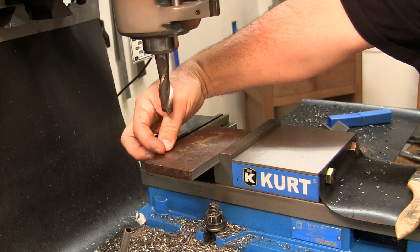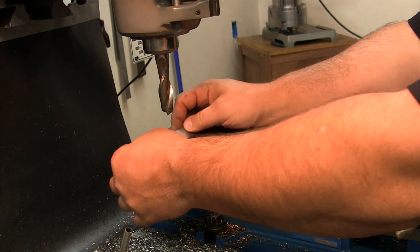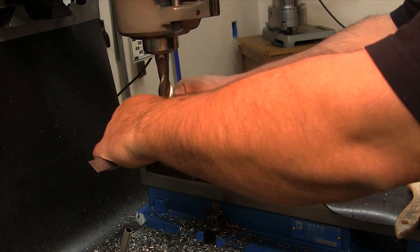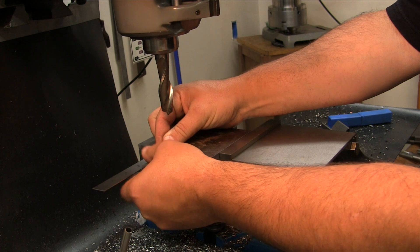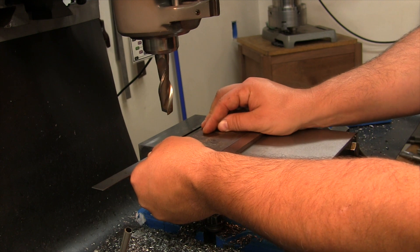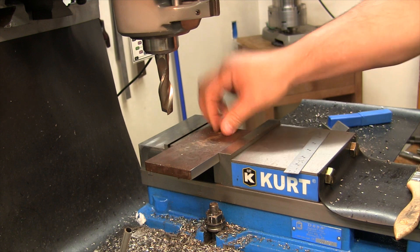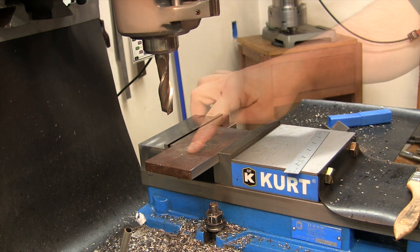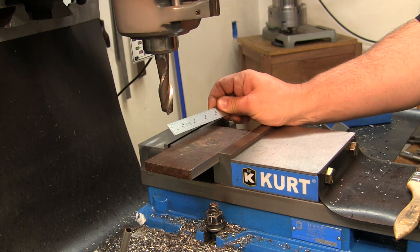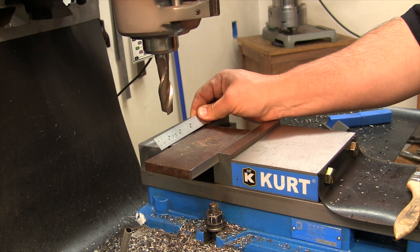The flat part is an inch and a half wide, so three quarters on either side of our hole. I should do it from this side — three quarters. I want this thing off of the vise, make sure it's out of the way, but biting down on as much of the part as possible. So we're going to drill and then we're going to start to bore this out. It should not interfere with the vise at all because there is three quarters.